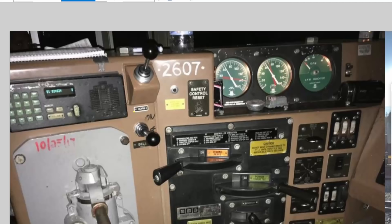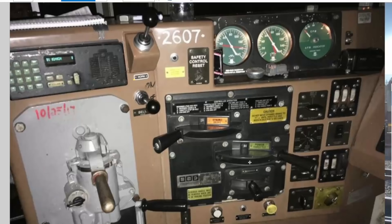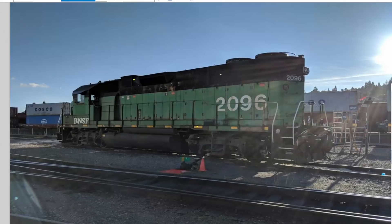Level five is dynamic braking. The dynamic brake handle: throttle set to idle, reverser thrown — you can move the dynamic brake handle into setup, then notch it up through eight notches, just like the throttle. Dynamic braking means rather than using our electric motors as motors, we use them as generators. Normally, when you apply electrical current to a motor, it creates mechanical rotation. In dynamic braking, we apply a resistive load to the motors instead — rather than supplying current, we're asking for current.